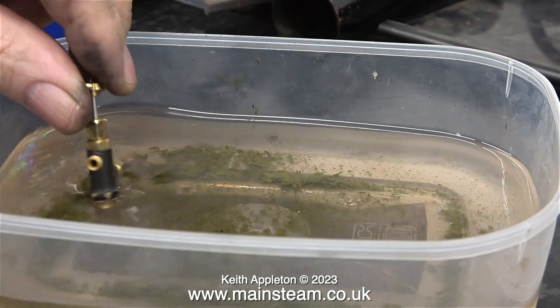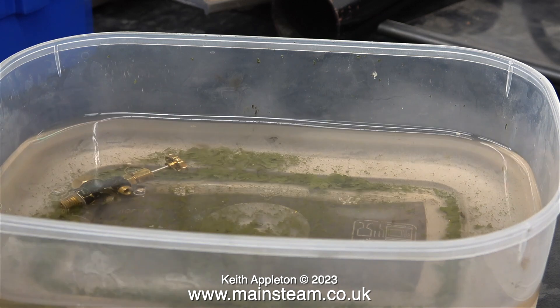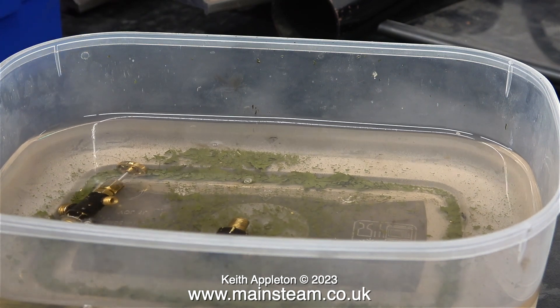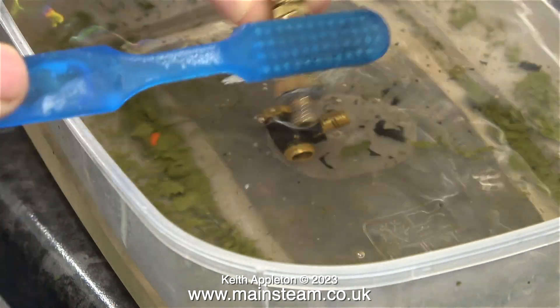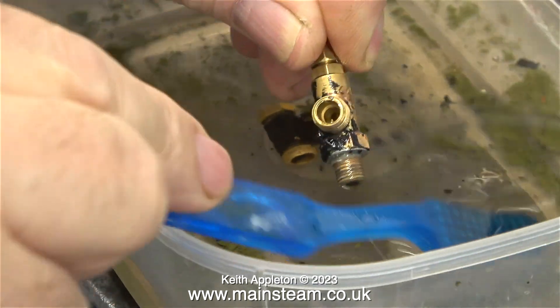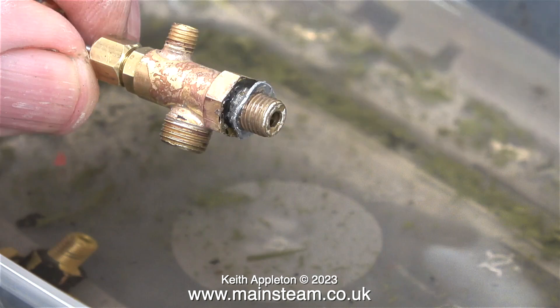While the boiler has been cleaned and descaled I can remove the paint from the water gauge fittings. In my second workshop I'm putting the fittings into a food container which is part full of cellulose thinners. I'll leave the parts like this until the next day, when I find that almost all of the paint has fallen off and I remove the rest carefully using a toothbrush. It's not a good idea to touch this stuff with your fingers, and you certainly don't want to get it in your eyes — suitable PPE personal protective equipment is recommended.